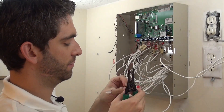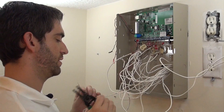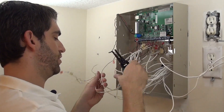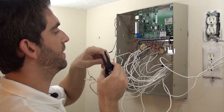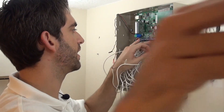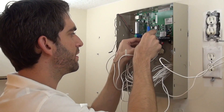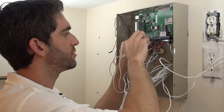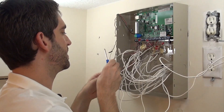Connected in. This is our master bedroom sliding doors — that's the double slider. We've got two loops running in series. We're going to land our negative, shared in with this one we've been working on — this ground in between Zone 3 and Zone 4. This is actually our fourth resistor on this one, showing how these two zones are used along with four zones, hence the doubling.